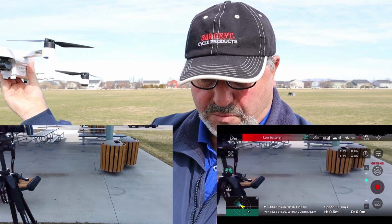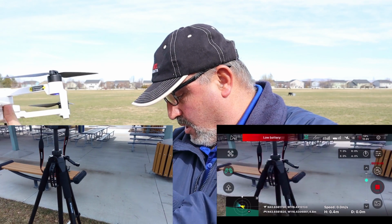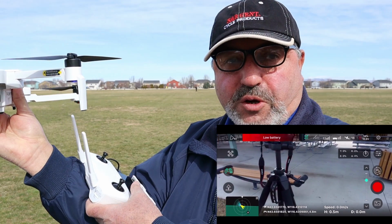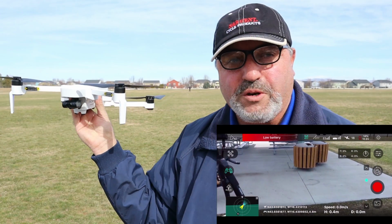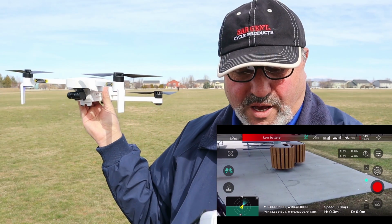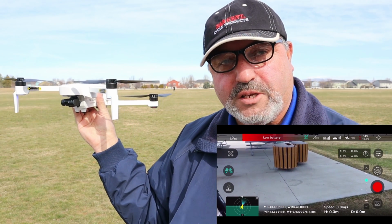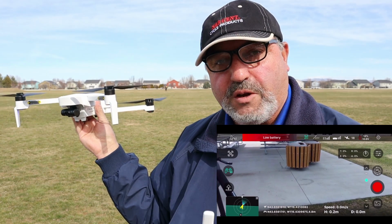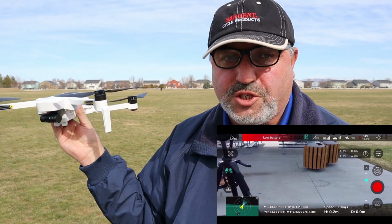So anyway, let me shut off video here so that way we don't end up with a corrupted file. Save the video. That's important to remember. I think I mentioned that before on the Zino. Always shut off the video recording, because otherwise, if you shut off the drone, you'll get a video file that's not closed out, and it'll just show as corrupted.